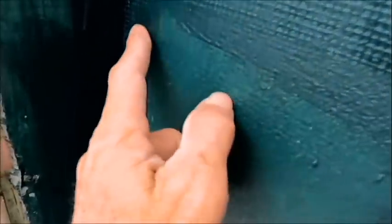We have cement board here which is okay, and they put tape in and waterproofed everything. But one reason I don't like tape is you really have to press it into the corner. It wants to bend, and you have all these little holes you have to go over three times to really fill them. Whereas if you don't use tape, you just mud the corner and your waterproofing wraps around all the mudded area - the waterproofing is a crack preventer, same as tape, so using both is redundant.